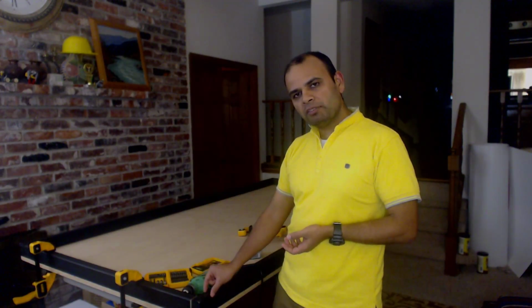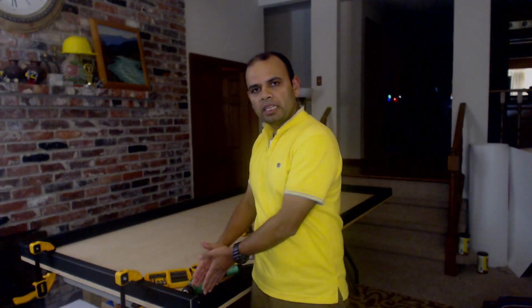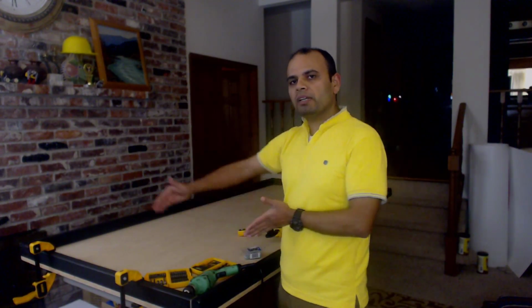The reason this is 45 inches, even though the actual plywood is 48 inches, that is to say 4 feet, is that once you put this wood down, it's 1.5 inches, as I had already told you, and then 1.5 inches on the other side. So from the edge of the plywood, we move 1.5 inches this way and 1.5 inches that way, and we get 3 inches less than the width of the plywood itself. So that is 48 inches minus 3 inches for the sides, and that comes to 45 inches. So 8 feet this way and 45 inches this way.